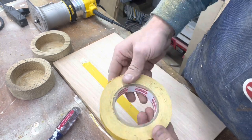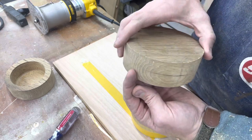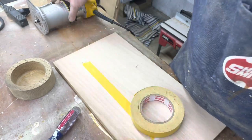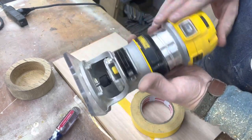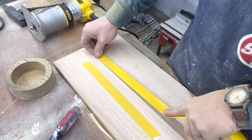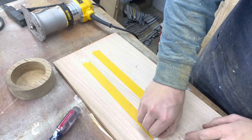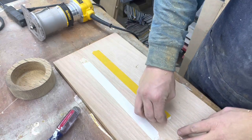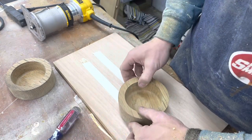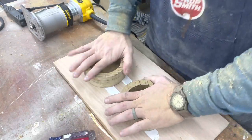Back to the double-sided tape again. You can easily take this thing up to a router table, take it up to the bit and turn it, or put this thing on top and turn it. If you don't feel comfortable doing it that way, or if you don't have a table router, then use a palm router. The double-sided tape becomes your best friend because everything's on top and you have more control. We'll just stick that on there, peel these up, place this down, and put two of them on there — these aren't going anywhere, just like what we had used earlier.